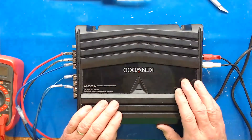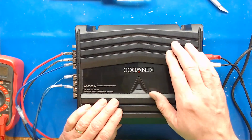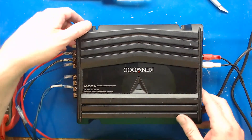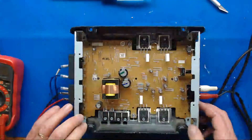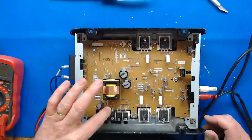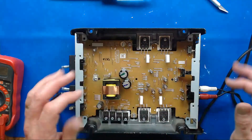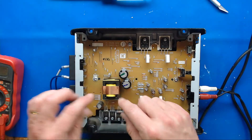I'd like to repeat that testing procedure with a bunch of different amps, showing different amp styles to make it a little more clear. Try to show power supplies — these are the FETs, they're labeled Q; these are the diode packs, they're labeled D; these are the outputs. This on this one's a little power supply transformer, normally it'll be a toroid.